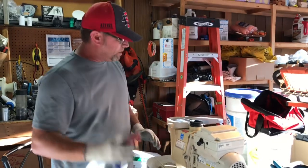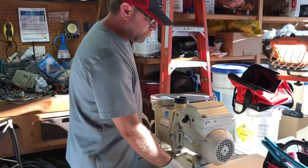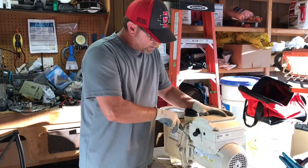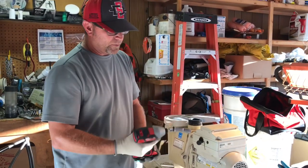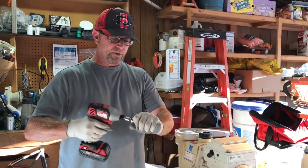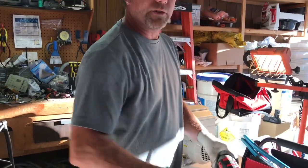What I use to get those off — if you have a leak, you've got to WD-40 these four right here before you start trying to get them off, because they get calcified and stuck real hard. Then if you've got a drive in the way, you've got to get an open-ended wrench on it to loosen them up. Or if it's just a single speed pump, I prefer to use my impact driver with the swivel head so I can put it right on there and swivel it any way I want and back it right out.